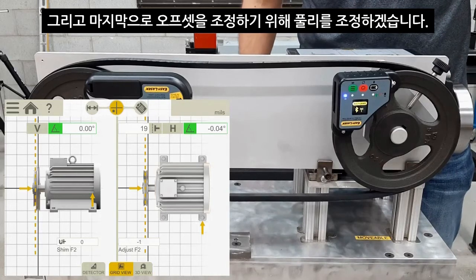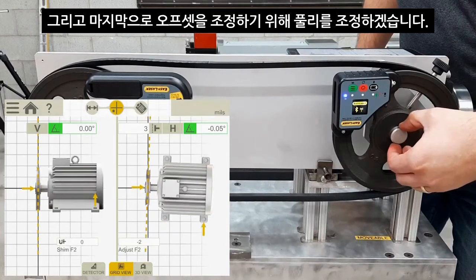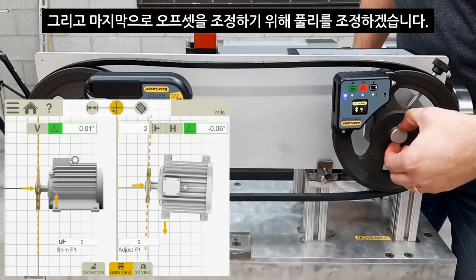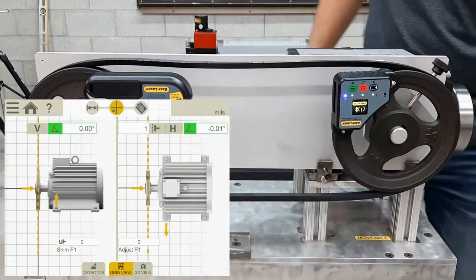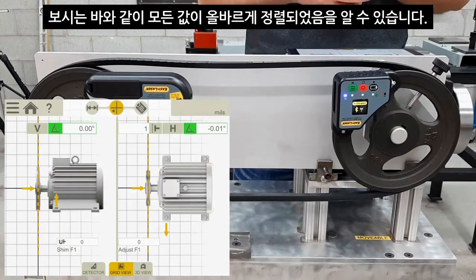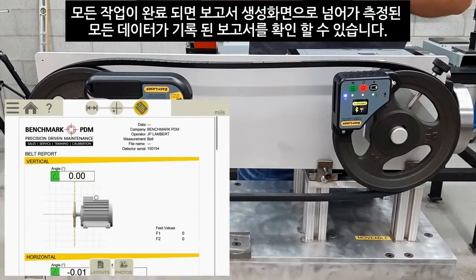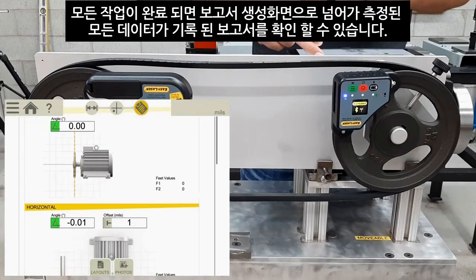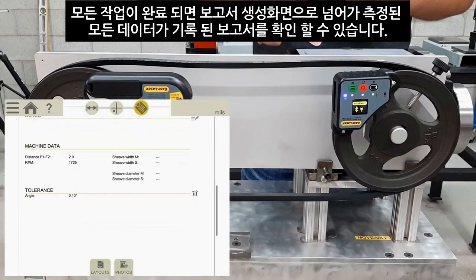You can see we still have 19 thou of offset or axial misalignment — and with that I'll just push it in, and I've already brought it very quickly to roughly 0. I would be happy with those results. As you can see, I'm very close to 0 all the way around. I would tighten everything down, do a remeasure to confirm repeatability, and then move on to the report section. As you can see, the logo and all the data are in there — we have the horizontal and vertical plane results as well as any notes and information we added.